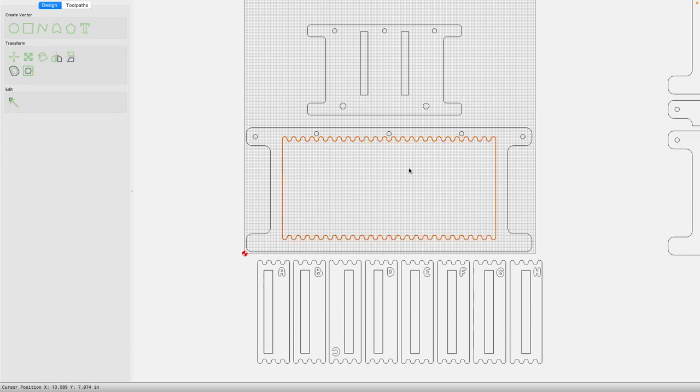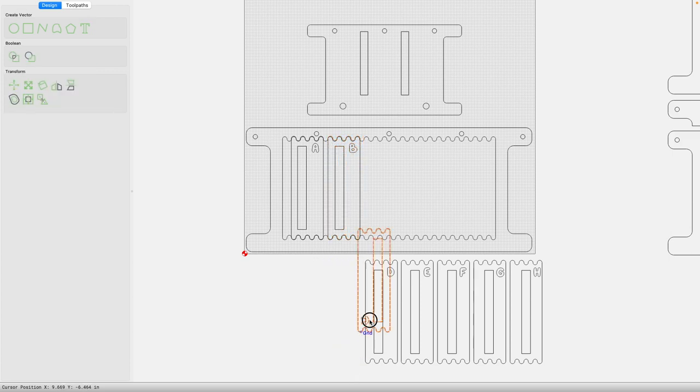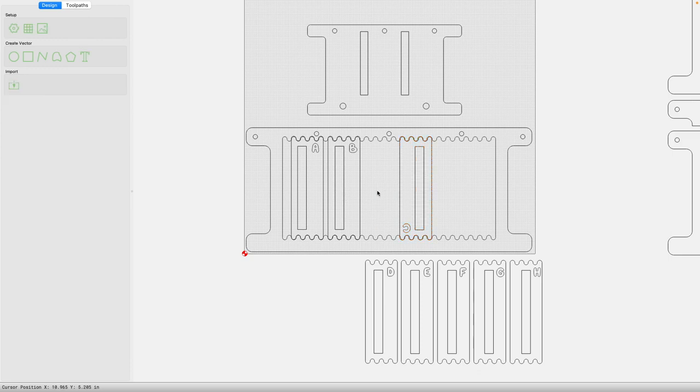The large void in the jig is intended to be filled with inserts. I have eight inserts, and the rectangle in the middle holds the guide bushing. That rectangle moves over as we go from A to H — in H it's in the middle, on A it's to the far left — giving a sixteenth of an inch incremental spacing for each one. That means I can tackle pretty much any dado spacing I need. For example, putting A then B in the jig, or even flipping C upside down to reference off the other side. You can calculate ahead of time which inserts you need for your project.